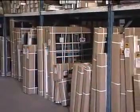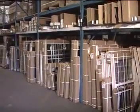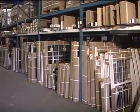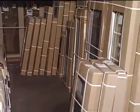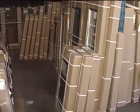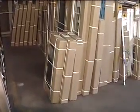It is important to note that care must be taken during the handling and storage of windows. To protect them from breakage, you should store them standing upright with a slight lean on a flat surface and under cover. They should have enough space between them to allow air movement. Do not store them outside or in direct sunlight because heat buildup can permanently distort some parts of the window.